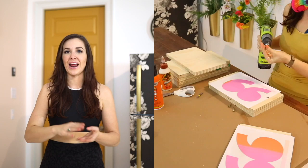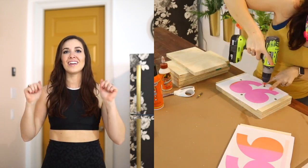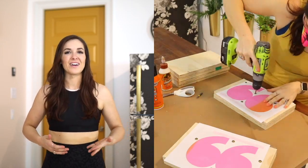I wanted my pieces to be exact replicas of each other so when I stack and glue them I don't have a ton of reshaping to do. Ideally I would cut all four pieces at once but my scroll saw isn't tall enough, so I had to cut just two boards at a time. If you're using a jigsaw you might get it all in one go. I attached my template to one board, stacked it with another piece of plywood, and attached them using screws in the dead space areas that will be scrap once I cut out my piece — that let me cut two boards at once, securely, with no wobbling.